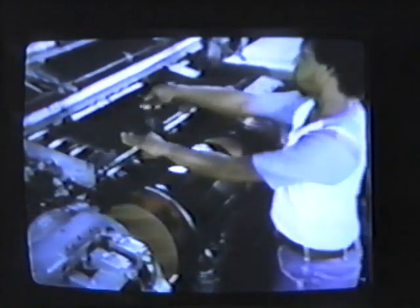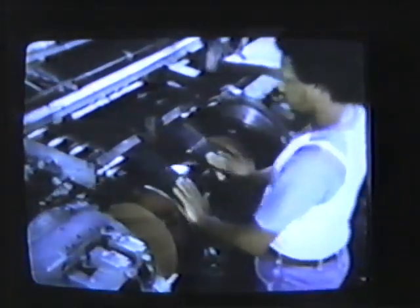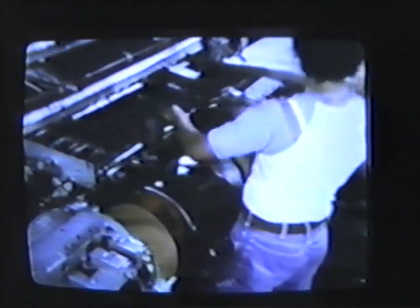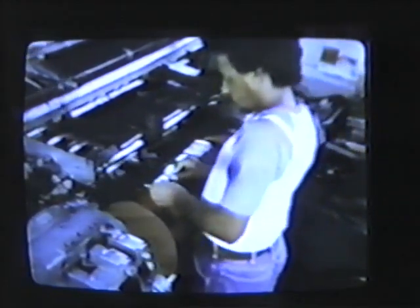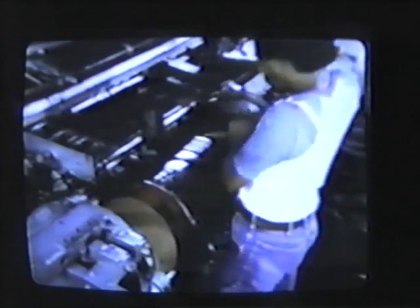Guide lights projected onto the building drum from a bank of overhead projectors assist the operator in precisely locating each sidewall strip, an extrusion comprised of a stripe of white rubber encapsulated in the black sidewall section. After cutting to length, the operator carefully splices the sidewall strips, matching white rubber to white, black to black. To assure a good bond, the splices are firmly knitted together or stitched with a pressure roller.